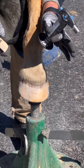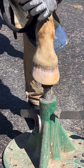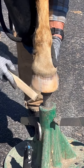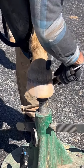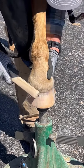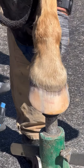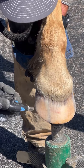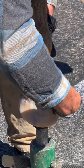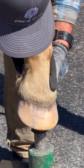Once that's done, I do a series of three repetitions: wire brush, torch, wire brush, torch, wire brush, torch — then you're usually good. You can see the dust coming off this foot. The whole idea is we go around as many times as needed so we don't have any dust coming off. Now I'm going to torch. It's hard to see the torch with the light, but we don't want to burn it — we just want to take out any outside moisture.